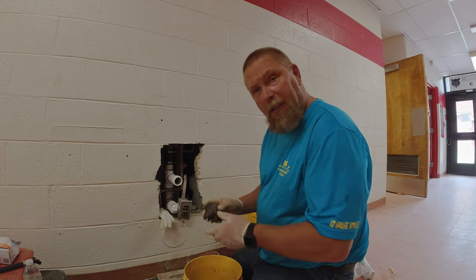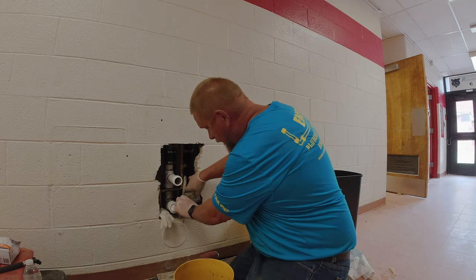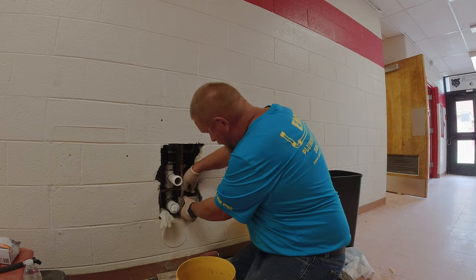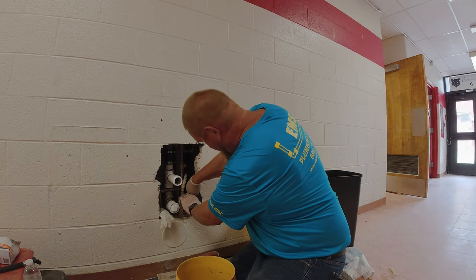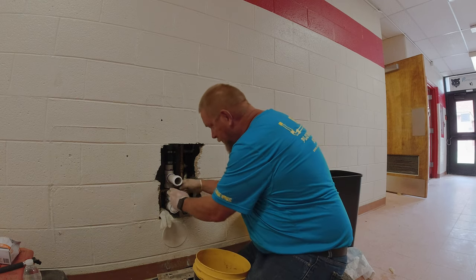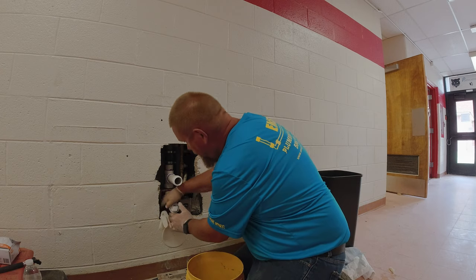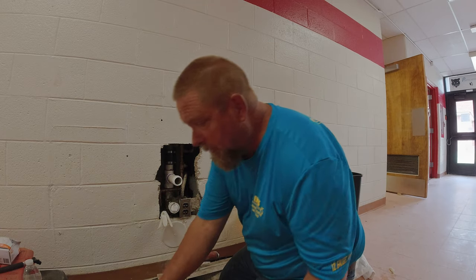So I normally will take a little bit of concrete and put it in the hole just to give you a bottom section, and then I'll shove that piece of brick down inside there — kind of wedge it in so it's not going anywhere. That way we've got the plug for the lower portion and then we've got some of our filler started. This concrete is already getting hard, so we'll quickly start to fill it and get it in place. That was our first section — we only used maybe three cups.